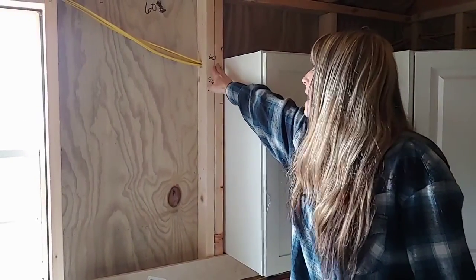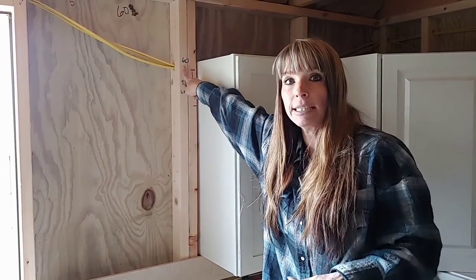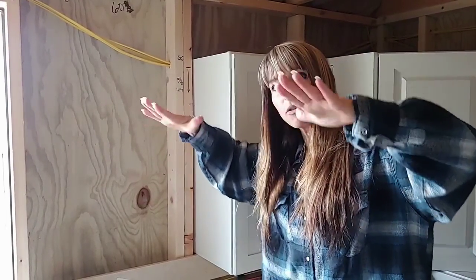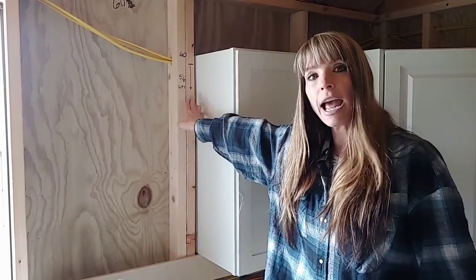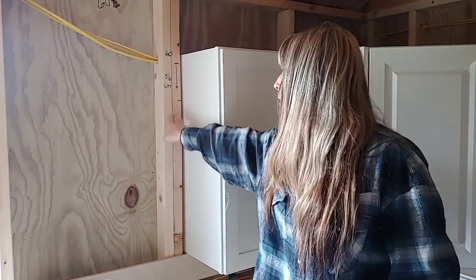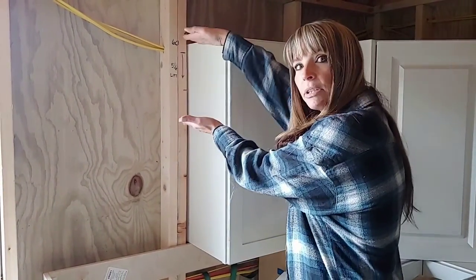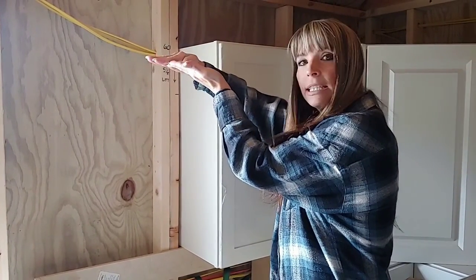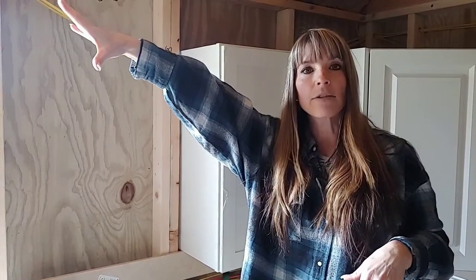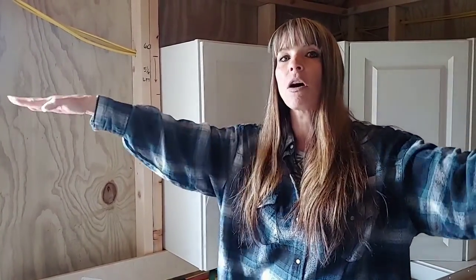Now the most drastic corner: when Chris measured from the ground up to that laser line, this was at 60 inches — it was crazy different. So this whole building was not only off in one direction, but it was also tilted. In order to get it to that 54½ inch mark, he had to actually raise this corner five and a half inches. Once he was there, that's 54½ inches. And finally, that other corner was three and a half inches off, and he had to raise that building three and a half inches to get it. So once it was all done, that green laser line from ground up was exactly 54½ inches all the way around.